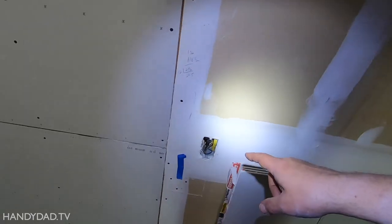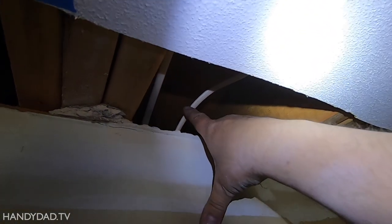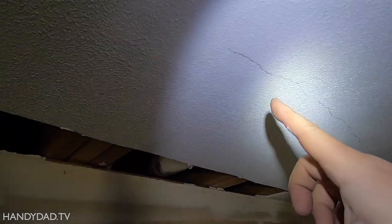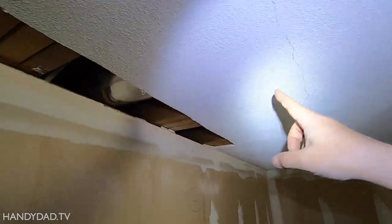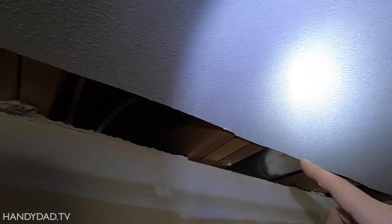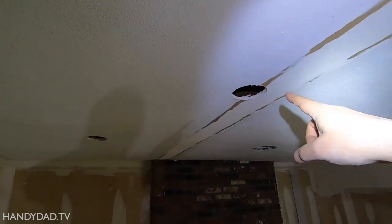So the switch turned power on to a wire that comes up to the wall, and it's this one right here. I tested that with my tester, so I know this one is hot all the time. This one is switched and it goes in that direction. I could actually feel it. So I put a line on the ceiling here because I could stick my arm up and feel it. What I was trying to do is pull that wire so that I could get it into this hole. This is one of my new lights.